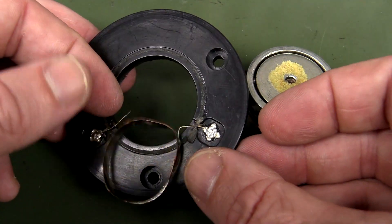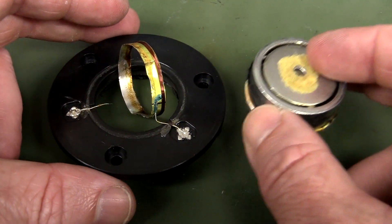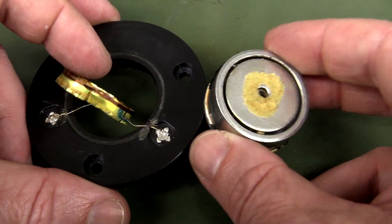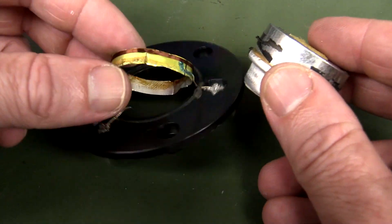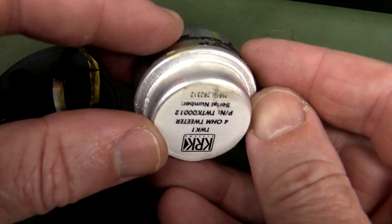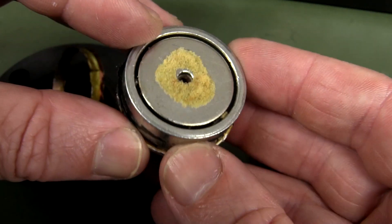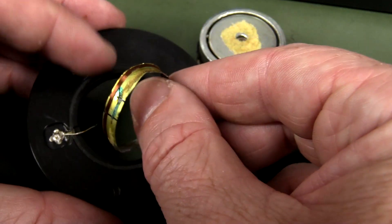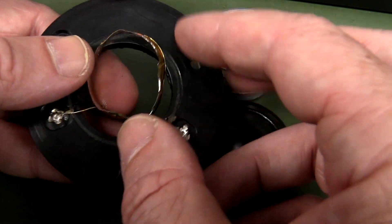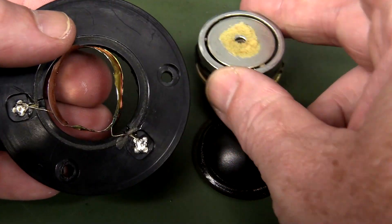You could probably rewind your own coil, but that thing's just cactus. You're better off just paying 30 bucks or whatever for a new one, especially given the massive excursions that went on this — it would have just deformed all of the coil. I couldn't get that apart any further, but I believe that's just a permanent magnet assembly that the coil goes through. It's a moving coil design — it moves within the magnetic field.